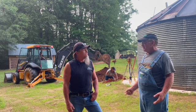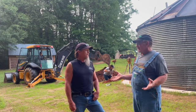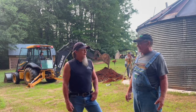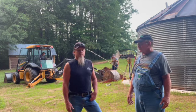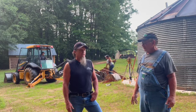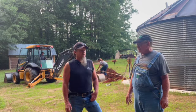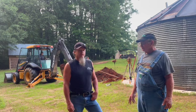I know you're also in the septic tank pumping business, right? Yes, sir. Absolutely. So what do people need to do to keep from having you come to their house a lot to have their tank pumped? What are some good tips for maintaining a septic tank? Well, keep your greases out of it. Just mild soaps and just toilet paper mainly. One of the problems we see is grease buildup, powder detergents, and stuff that shouldn't be in there, like personal wipes and so forth. So every 3 to 5 years, clean your tank out.